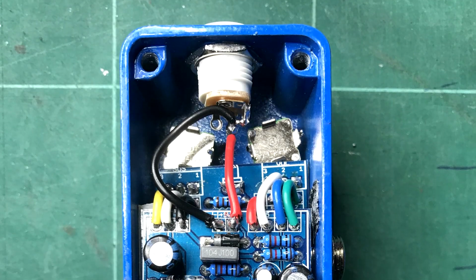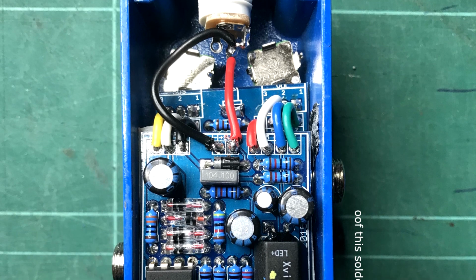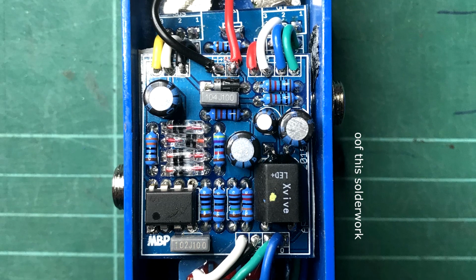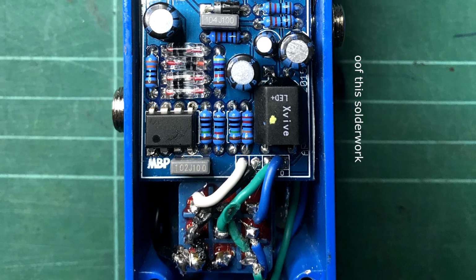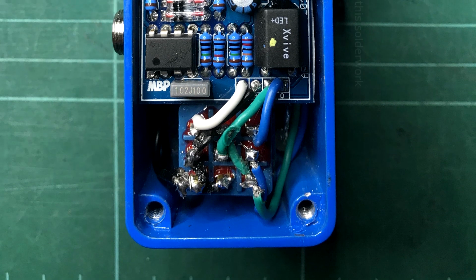The build does not require a ton of parts, and it is a daughterboard with mounted pots for easier assembly. Beware though, it is supposed to go into a 1590A enclosure, which in my opinion never really makes for an extremely simple and easy build. But given that warning, it is another very well-designed board by Madbean, as expected by now.